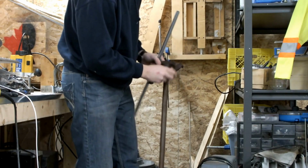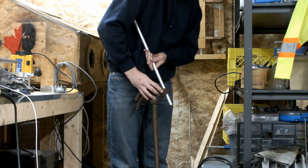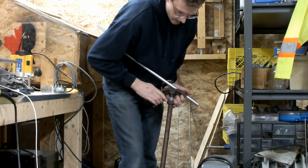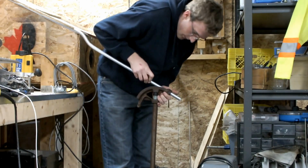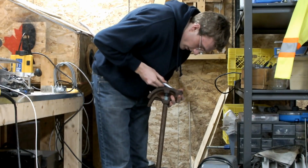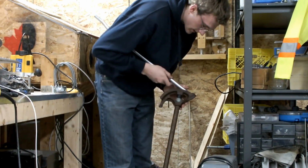So what you do is on the bender, there's an arrow here. Offset bends are usually generally called air bends. So you hold it up like this, you bridge your foot on the bottom of the bender's handle so it doesn't move, and you line it up good. I drew out the center line and everything because the angles are weird. So your first mark, you line up with the arrow. There's one on both sides.